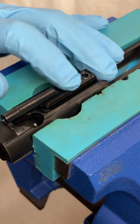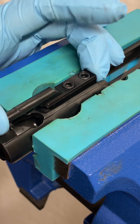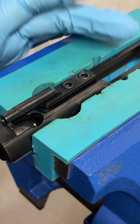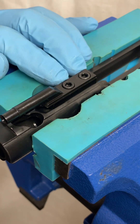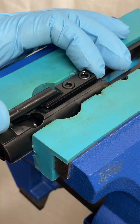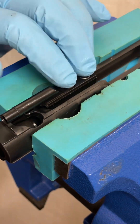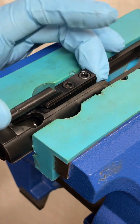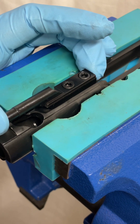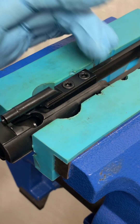42 is pretty high, but this front one broke at 36, which is more in line with what I usually see with these gas key screws coming loose when properly torqued with lubricated threads and no staking. If we remember, the previous carrier we tested was staked and it failed at or below 30 inch pounds. So if this carrier also had staking, I would be willing to bet it would have taken a little more effort — maybe an extra inch pound or so — but it would have likely taken more force to loosen these fasteners.